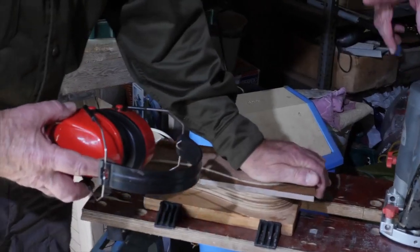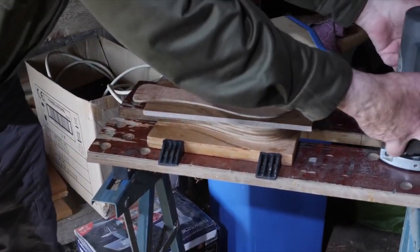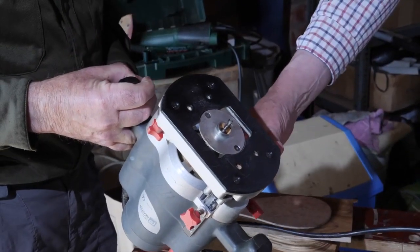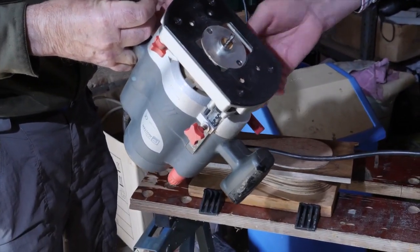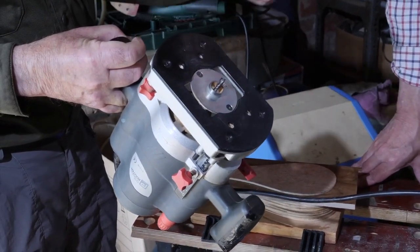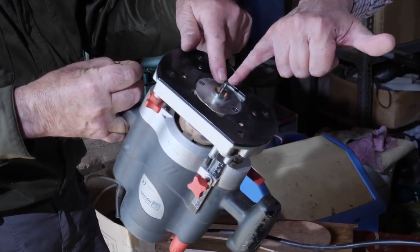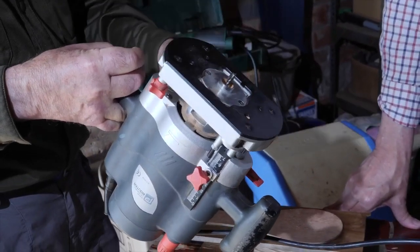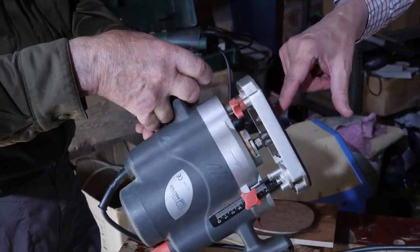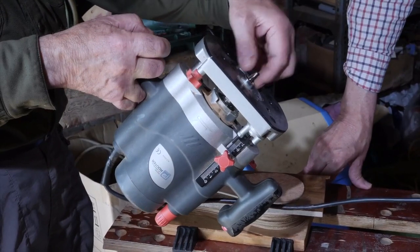Okay. And then what are you going to use to do the cutting? Oh, you want to see, that's the cutting tool. So it's an ordinary woodworking router. Yes, and a straight cutter and a guide bush. I've got the dimensions on that paper there. I can't remember. And the guide bush was 6 millimeters from center. Yes, that gap, 6 millimeters. So that's really why you have that 6 millimeter gap. Yeah, that's it. If you had a different guide there, you'd need to make sure. Oh yes, you could get different diameters of all these things.